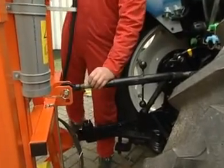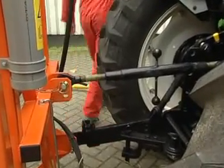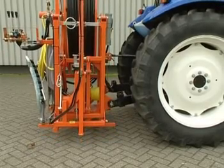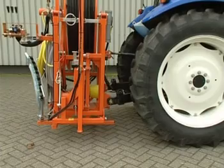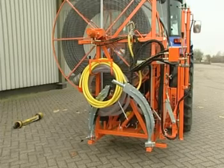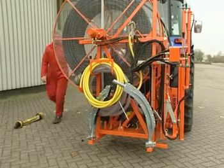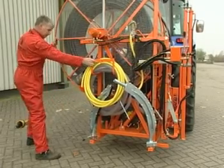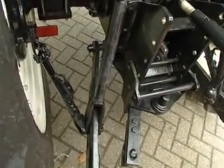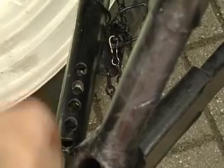Then lift the drain cleaner to the right working height, roughly 10 cm above the ground. It is important to minimize transfer movements of the implement in order to prevent damage. Compensate any play by setting the stabilizers at the right length and locking them.